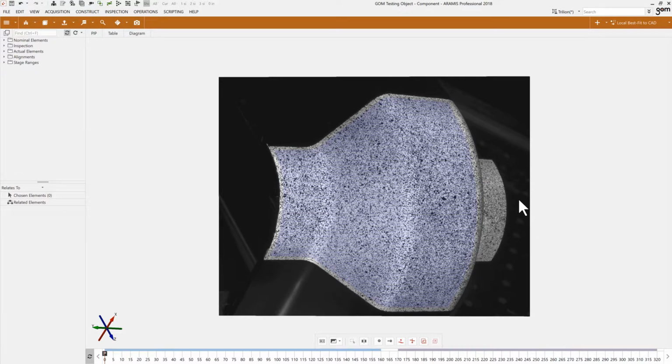And let me now talk about the virtual strain gauge positioning. One of the great things about the DIC data is since we have a full field data set, we don't need to know beforehand where exactly we should put our strain gauge, and we don't need to mark the exact position of that strain gauge. We can simply use the CAD file to find the exact coordinate location of a point and define a strain gauge at that location. We can also do the other way around and end up at the end of the test seeing a maximum strain in a specific location, defining a virtual gauge there, and then locating that in the CAD coordinate system to know exactly where it was at the very beginning of the test. So let's look at those two things separately, and that will encompass the live demo about virtual strain gauge.